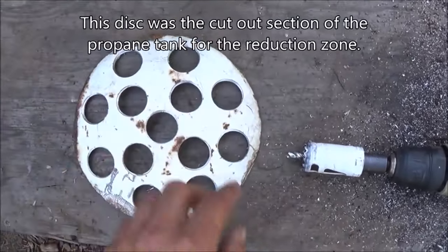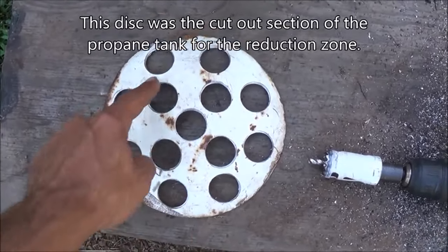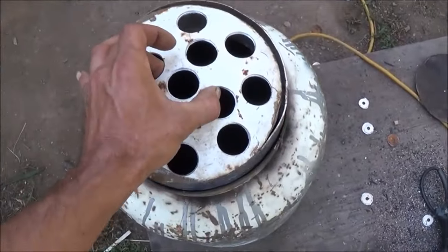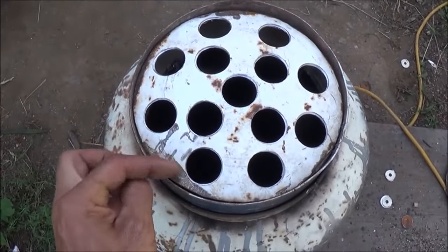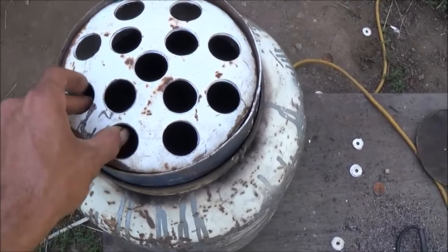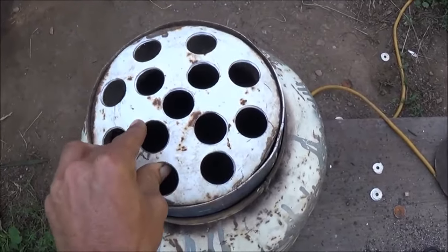What I'm working on now is building our screen for the gasifier. I've got a 29-millimeter hole saw and I just went through and did a pattern — you can see through the holes here. On the outside pieces, wherever one would fit you can go in between and add one more hole if you wanted to, but this should work just fine. That screen is going to sit right here inside of our reduction zone. I've got some marks where I'm going to cut a little slice out, weld a block of metal to the inside of the reduction zone, put a pin through there, and weld that together so this can open up just like the last one I showed you. We can use the cable to do that from the other side so you can shake your screen.